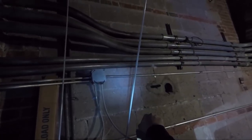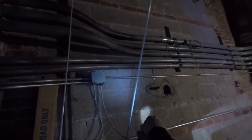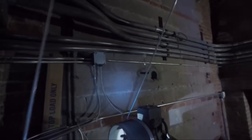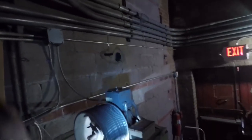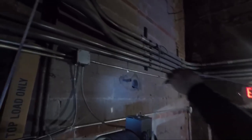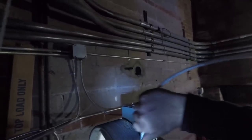Part of the problem with a new cable is that it's going to stretch a little bit over time, so I have to pull out all the tension in the system and actually pull the whole track system towards the motor by about four or five inches, so that as it stretches out over time — or especially when the theater heats up in the summer — the curtain moves back to exactly where it's supposed to be as the cable stretches.